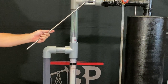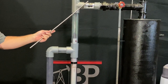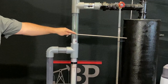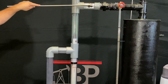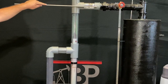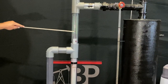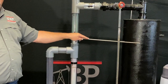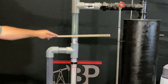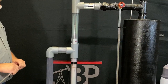Also, you will have a valve right here on your gas section. This piping comes off of the top of your vessel where the gas section is and provides equal pressure in your water leg as in your vessel. If this becomes plugged or the valve becomes shut, you lose your gas pressure inside your water leg, and that creates a siphon effect — the gas pressure in your vessel and the water level in your vessel will cause the water to siphon up and out, draining your heater down and causing you to lose your level.